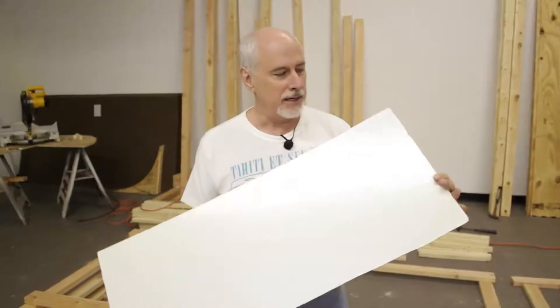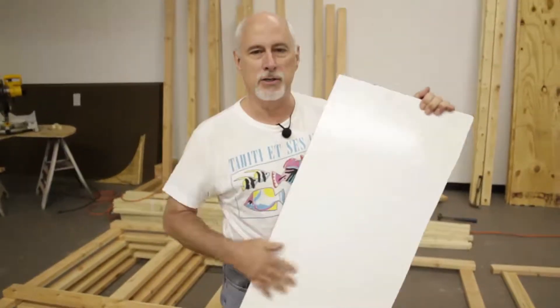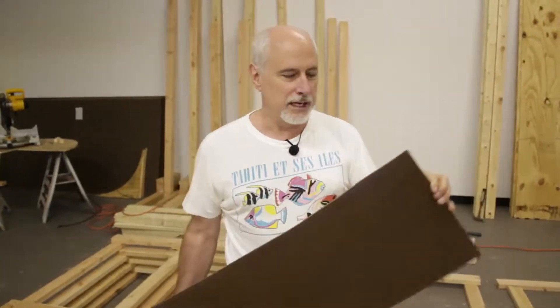We're using Masonite for our curve. I bought the white-sided Masonite, sold at Home Depot and Lowe's — designed for easy wipe-down, you can even use it as a whiteboard. But we're flipping it over and using the other side. The reason I chose this product is it's a very dense Masonite — flexible but quite dense. If you use the softer Masonite like you find in pegboards, it distorts too much with changes in temperature and humidity and can get buckles in the wall, then shrink and pull on the screws under opposite conditions. So I wanted something thermally stable in terms of dimensions.